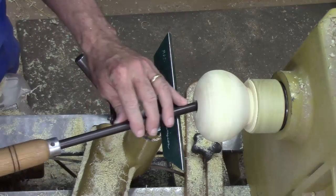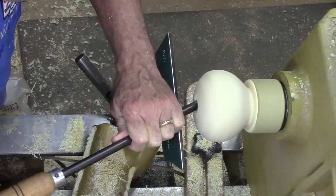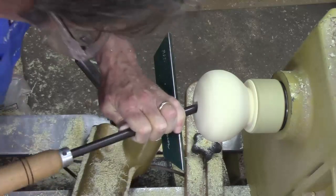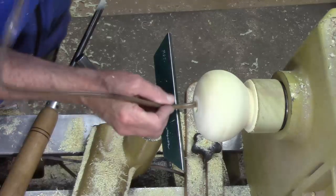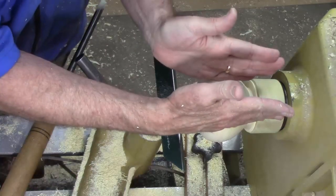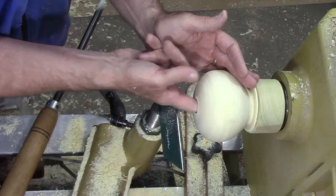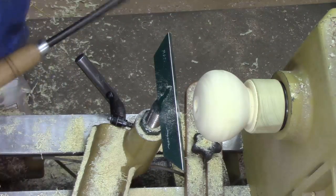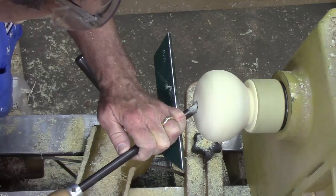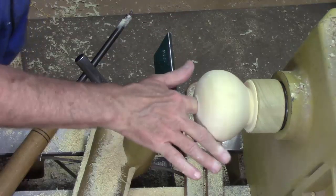In this case I'm going less than three inches, so this tool is a good fit. I'm just going to hollow out the center here, take that three-quarter inch, and try to make it a little bit broader. Because I'm hollowing parallel grain — parallel with the axis, just like a typical spindle — we're going right into end grain and we're just going to get a lot of dust, not shavings, regardless of what tool we use. We've cleared a little room for chips to build up so we don't have to clear it quite as often.